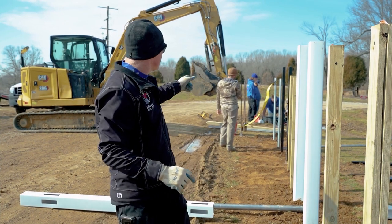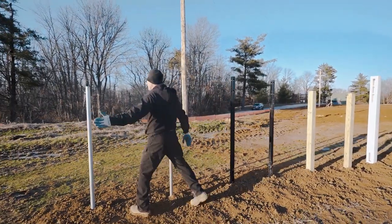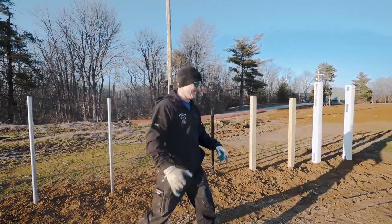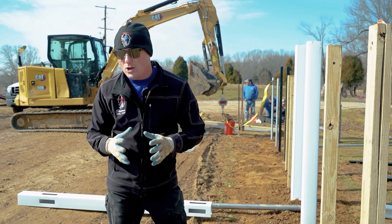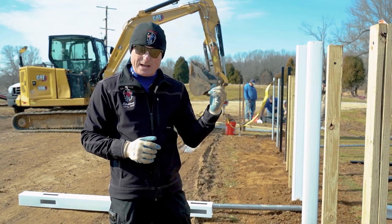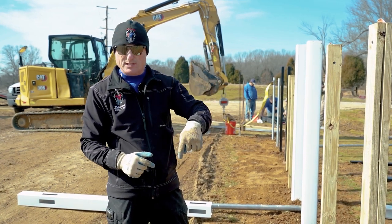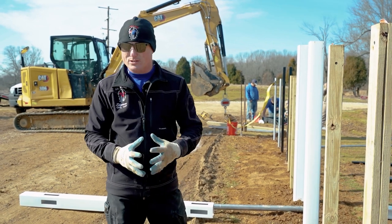Then the next two posts are 2 inch schedule 40 steel posts you typically find maybe on a commercial project for a line pole on a chain link fence. One's wet set, one's dry pack. We've known before, we thought, you shouldn't dry pack on a round post. It's hard to get compaction. So in that situation, we dry packed the hole first and then drove the steel post into the dry packed concrete that day. And then now we've allowed it to harden up.